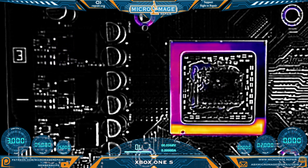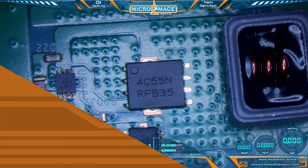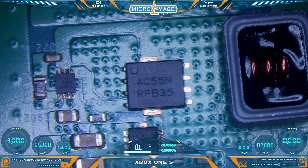As you can see, we have a power MOSFET getting very hot. Now, the thing to know about voltage injection is it's not always going to be as simple as changing the hot spot, but in this case it is that simple. Our problem is that power MOSFET right there. In order to replace that bad one we're going to need to pull one off a donor.